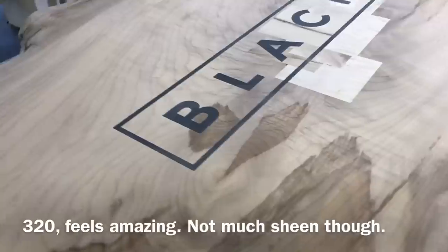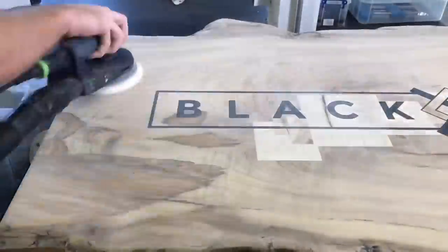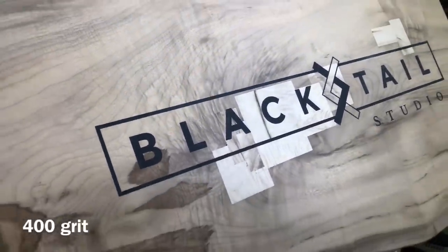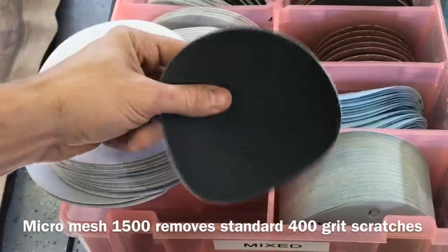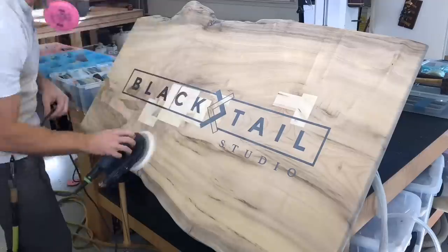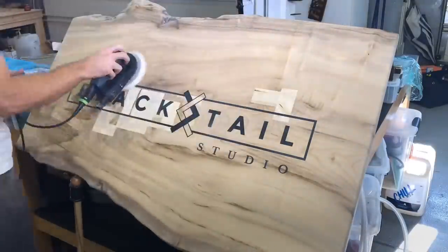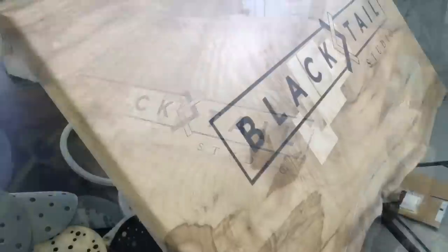For a normal table that I'm finishing with Odie's oil or Osmo, I like 320 to 400 — I think that's the perfect medium grit, not too high, not too low. For this one we're going all the way up, but normally for a hard wax type finish I would stop at 320 to 400. Now we're moving on to these micro mesh abrasives — these are specifically called micro mesh — starting at 1,500. They say to follow 320 grit; I went to 400, but they recommend following 320 with the 1,500. Go vertical and then side to side — you don't go in a circular motion with micro mesh abrasives. Moving on to 1,800. Another thing I like about these is the soft pad that comes with them. You don't get dust collection, but you're also not making a lot of dust — you're really just polishing the wood at this point, barely sanding it. Again, up and down and side to side.